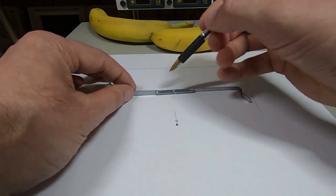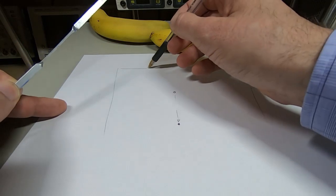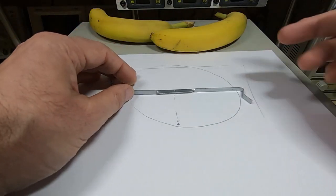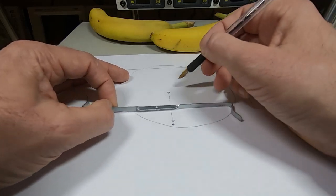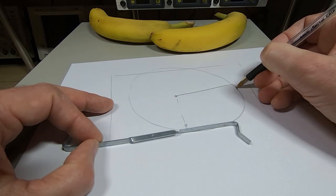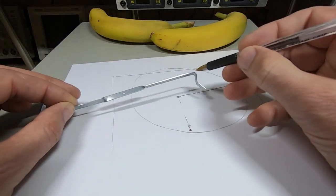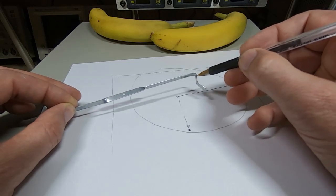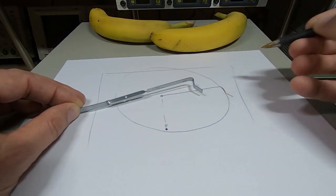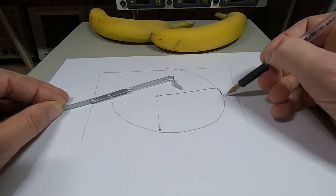So if you imagine drawing a circle that's the diameter of this fan blade, call it a fan blade, it's not really a fan, then taking a section, so if you imagine you draw like this and then follow the circle around, that's this part. So you've got this straight piece, this part is following the circumference of the circle, and then it kicks out at the end at about 30 degrees. So, and it spins that way.